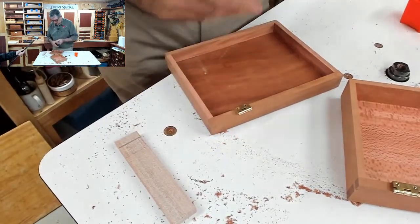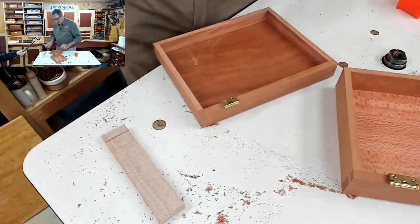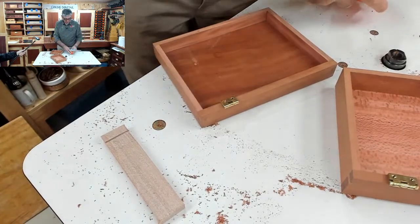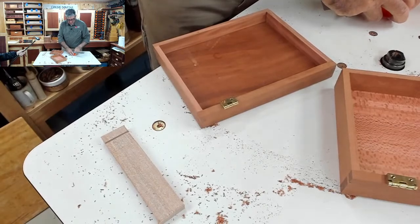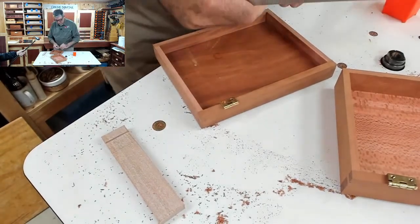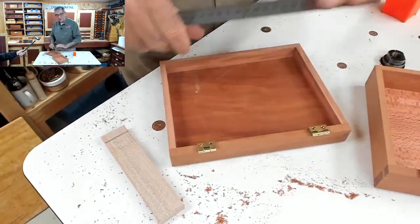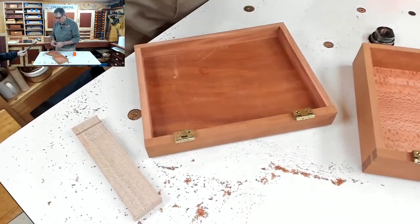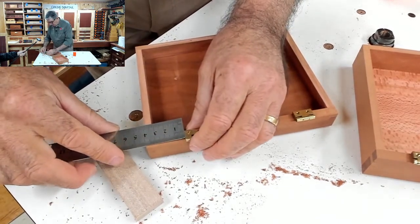So if I do that at 30 mil as well, it looks way odd. Where's the other hinge? There it is. Looks really odd if I do that one at 30 as well. So you can see the difference, you know, like the same size box, but that looks really awkward. So let's push it out another 10 millimeters. Take it to 40.